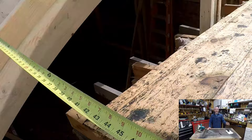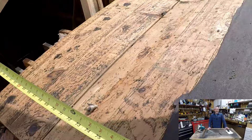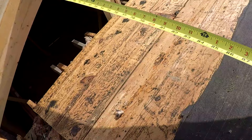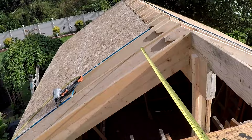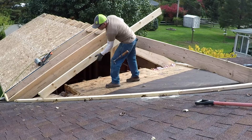Here's how you pull and mark your long point. There are a lot of intricacies with angles, and we'll get into that. When you pull off them, you just run and lay out every 16 inches — your tape measure should be marked for it. For the long measurements, I use a board: I put it right at the end and mark it at the ridge so I can pull the measurements off that, because your tape measure doesn't want to stretch out that far.